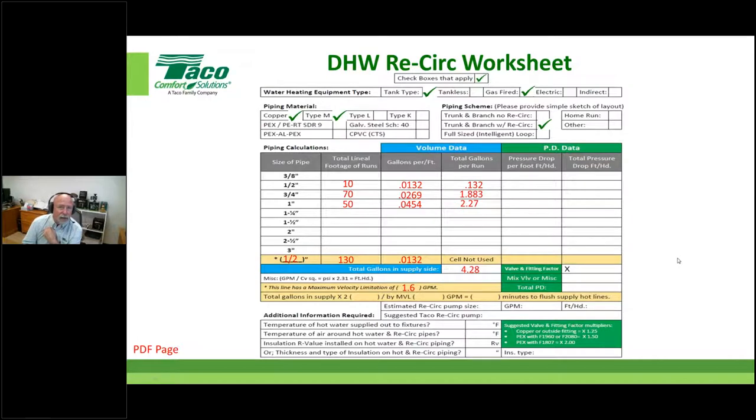A lot of people put it back in the mechanical room, and some people just strategically put it out at the last fixture group. So depending on where you put the aquastat kind of answers that question. It might give you a slight delay if you put it back in the mechanical room. But the problem with aquastats in the mechanical room is they can get a false higher reading than what's actually happening out there. That's a control strategy question, and we can cover that in another session. Short answer there is aquastat location is a balance between the best place to put it and the most convenient place to put it.